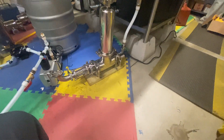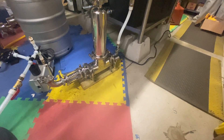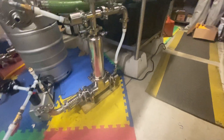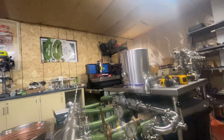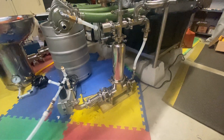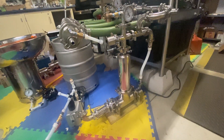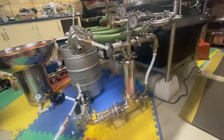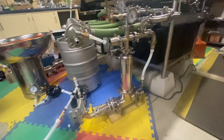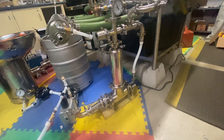You'll be able to do super controlled tests — 3000 watts of electric thermal in — and then we'll be able to see exactly what we can get out from the turbine. The Rankine thermal cycle puts a lot of energy towards the latent heat of vaporization, and then what's left and what pressure you get it up to is what's available for expansion before it starts to form condensation droplets.